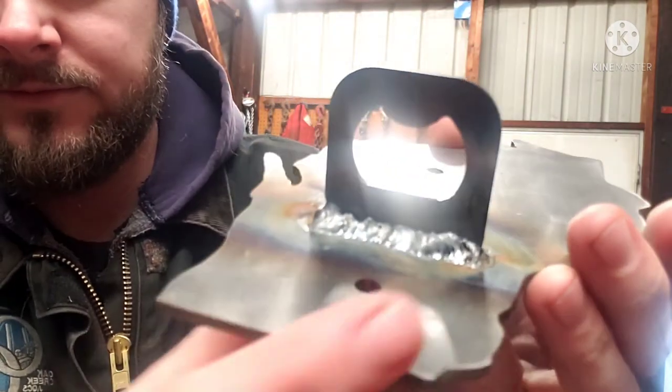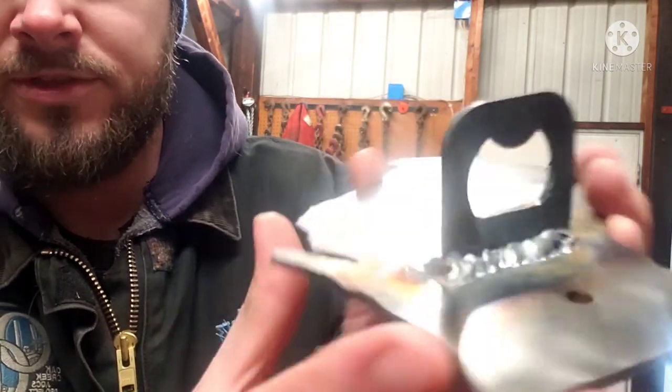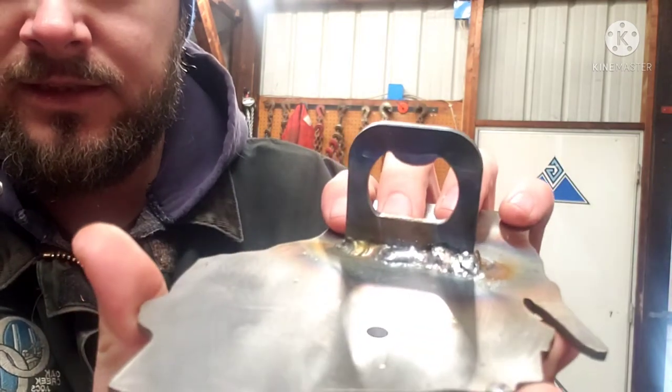So I was getting frustrated with that. My TIG weld was not good. Let's see, we got some wormholes, inconsistent, and I only went through, I don't know, three pieces of tungsten I had to sharpen. The camera ended up cutting out on my phone because the storage was full and the battery died while I was welding that first piece, which, like I said, you didn't miss anything.